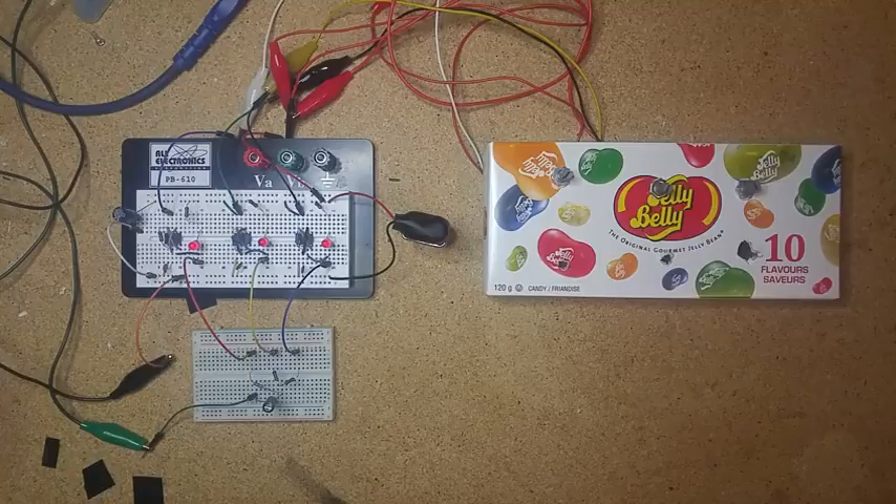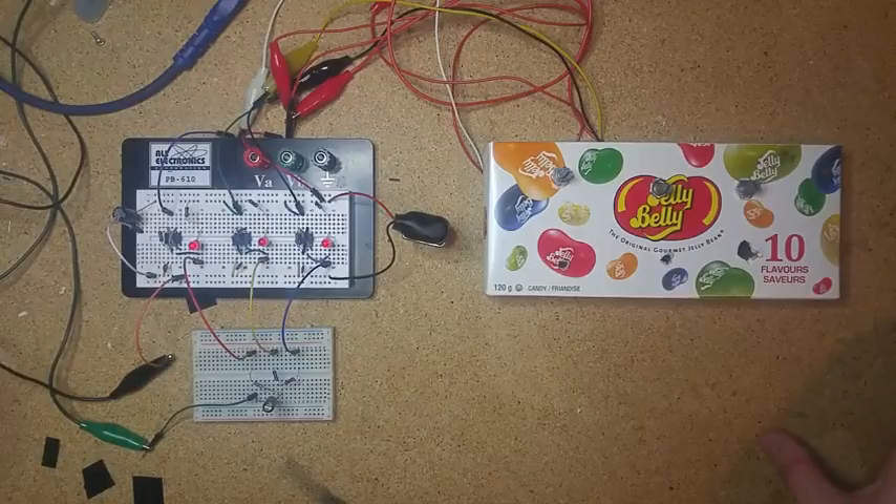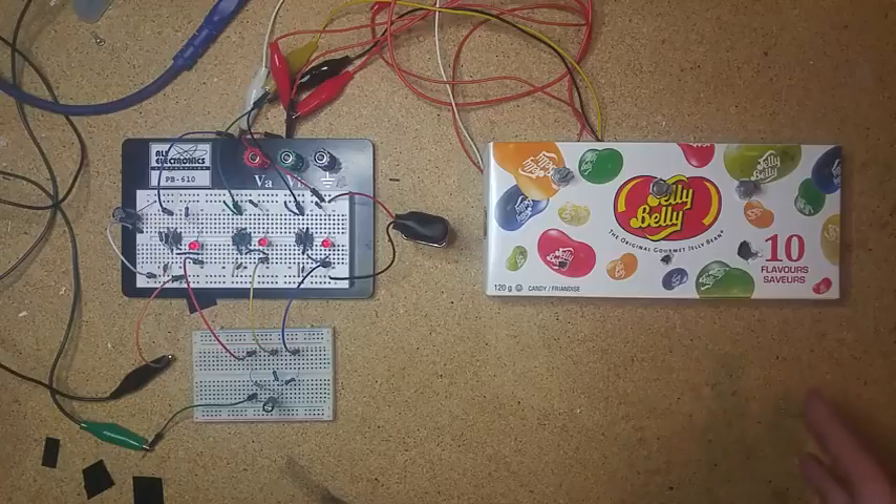What I've got is a very simple drone synthesizer. Now if you're unfamiliar with drone synthesizers, essentially what they are is you'll have multiple audio oscillators — each oscillator is creating a noise that you can control through a potentiometer. Those oscillators will all be mixed onto the same channel, and they'll overlap and compete for space on that channel, which can give you a very deep and interesting noise even when using very simple oscillators.